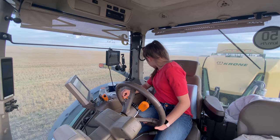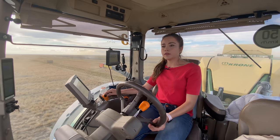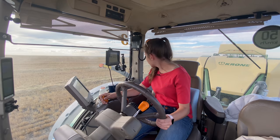I had to stop because the back plugged. We'll see if it's good now. Looks like it is. I was probably going a little bit fast here, even though there's not much straw in this at all. Setting my pickup for the baler back down. Looks like it just plugged again, so we'll start off kind of slow and see what's happening.